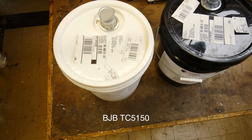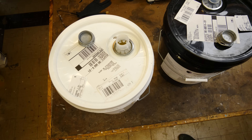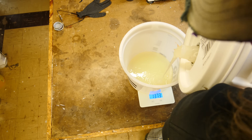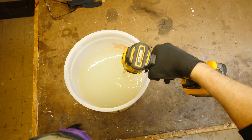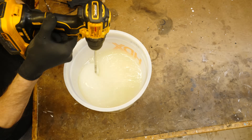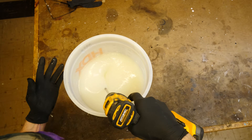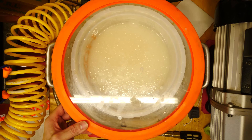When you make a cut mold you need a clear silicone that you can see through. Most tin-cure silicones are not clear, so we end up using a platinum silicone so we can see where to cut into the mold and see those blue lines. Cure inhibition was a big concern - we did a bunch of tests on various surfaces of the lenses to make sure we're not going to have any. This is a really big deal because you do not want to pour a huge block of silicone and have cure inhibition after spending $500 on silicone to make this mold.